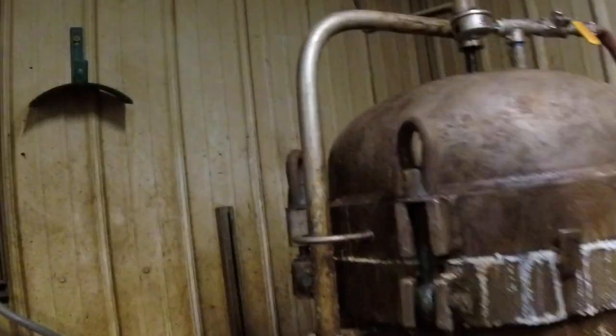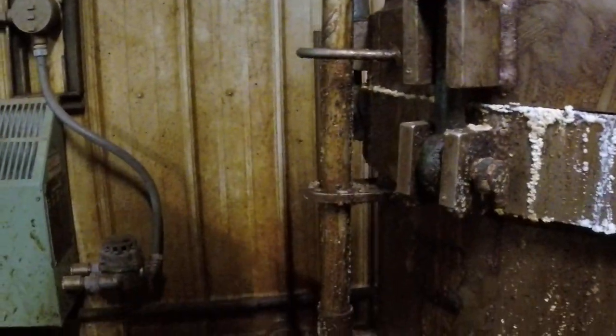Now you look to make sure nothing's leaking, make sure that's closed, and you walk inside. You open a little valve in here — it lets the water run and lets all the air that's in the line run through. You get water here. Once it hits water you know you're good. Water's coming out down there — there you go. Now the pump's on.